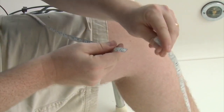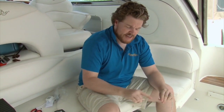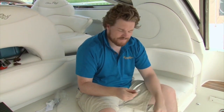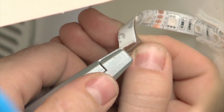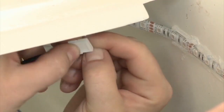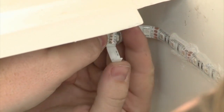Once you have it cut, you have a few options. You can leave it as a standalone strand, put silicone at the end, and it's sealed off and done. Or you can use connectors — L-shaped, for example, to go around a corner — or, as we're going to do, have some wire extend between the two so we can jump around that speaker and have this strand work in tandem with the other. Carefully peel back just enough of the thick clear rubber cover and snip that off. The exposed section will be covered with the connector — unclasp the plastic covering and those four metal shoes are what you slide the four copper spots under to hook it up.